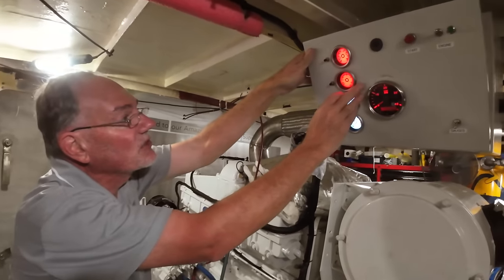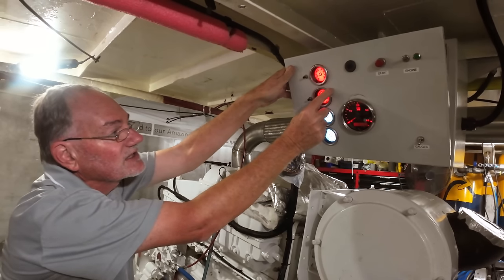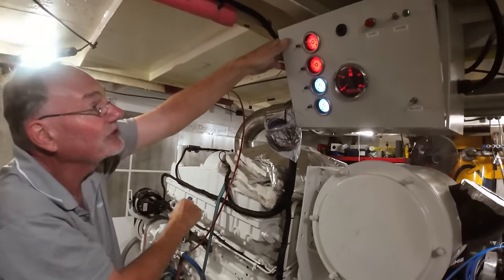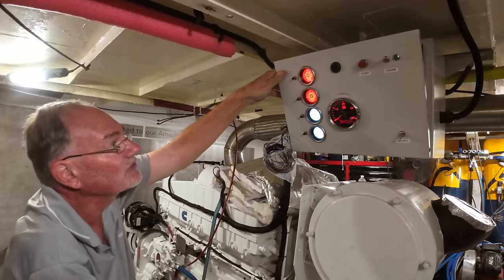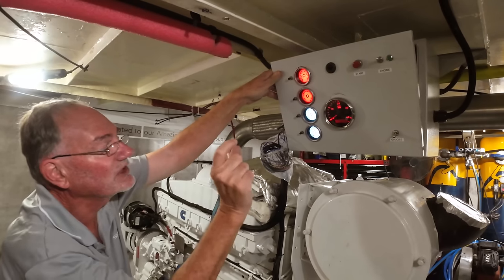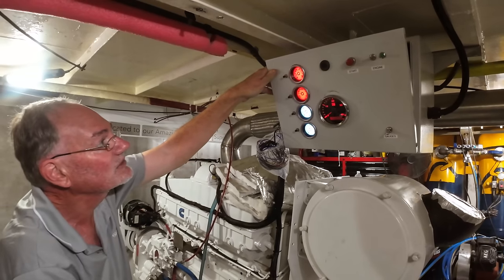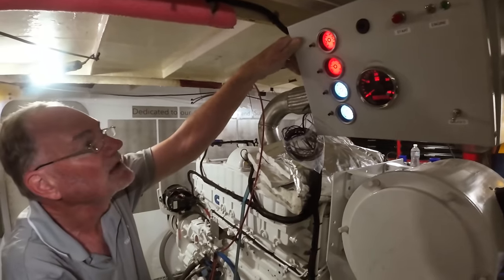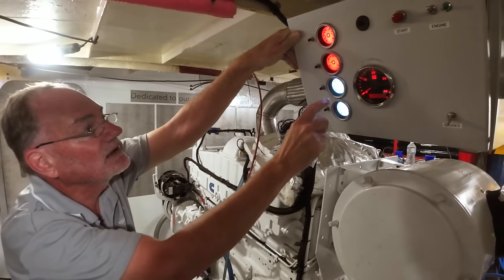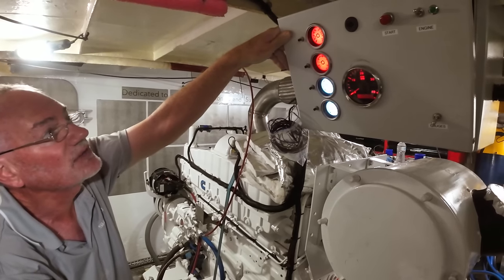Okay, so what are you working on this morning? Focusing this morning on getting the voltage reading on the volt current gauge here. The current sensor is already installed. It's up by the alternator there. And this is a 12 volt gauge, but we've got a 24 volt system. So I'm just going to do a very, very simple resistor network, which basically divides by two. So we're just going to remember whatever number we read there, we multiply by two. So that'll be the first point. And then I'll start working on the coolant temperature and then the oil temperature and pressure.